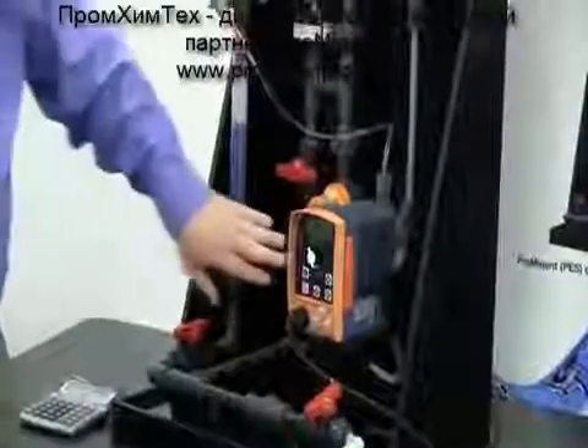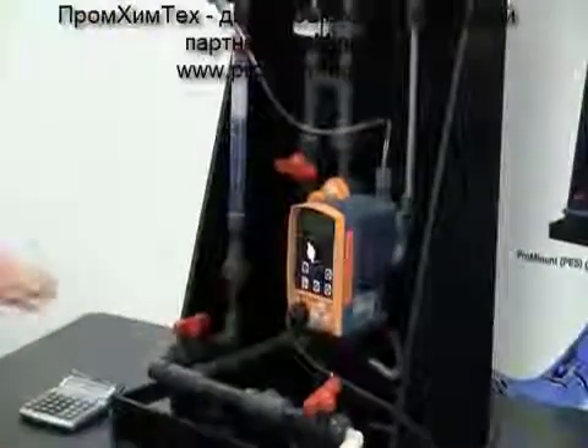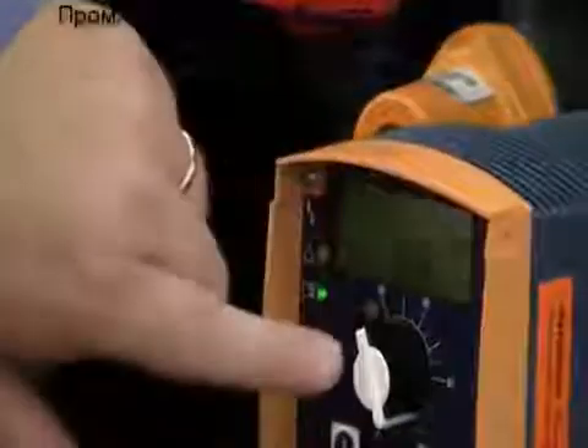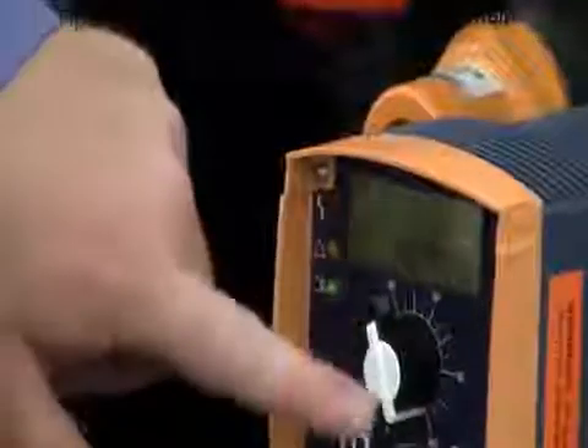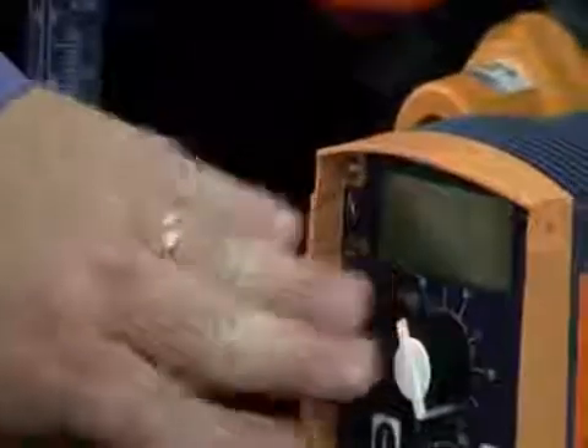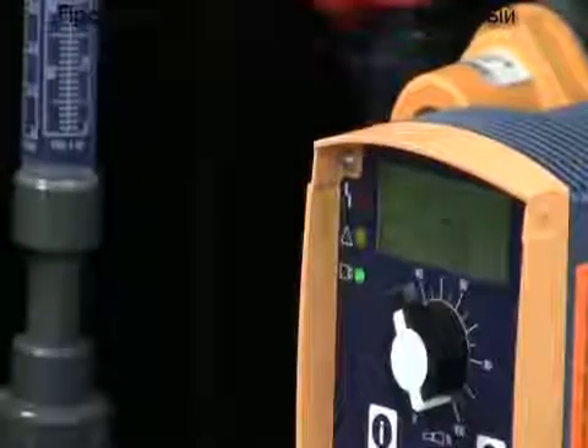It's important that we've adjusted our stroke length to about where we wanted it before calibrating. Once we've calibrated, if we change that stroke length by 10% above or 10% below, we're okay. If we exceed that, we're going to get a warning telling us that if we plan to stay at this new stroke length, we should recalibrate.